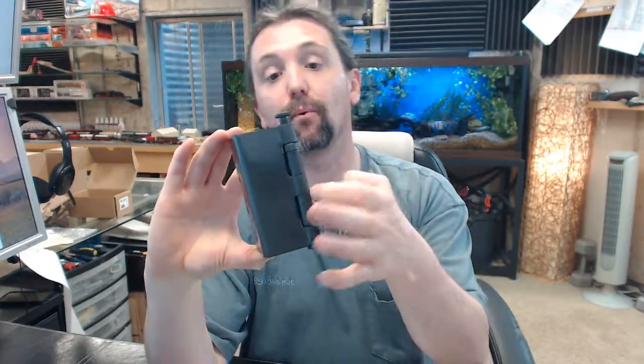This hinge is available in different base materials as discussed, and each base material offers different finishes. On steel you can get all the common architectural finishes — your brasses, bronzes, chromes, and nickels. On stainless, obviously polished or satin. On solid brass or solid bronze base material, dictated by the finish you want, you can get all common architectural finishes as well — polished, satin, antique, etc.